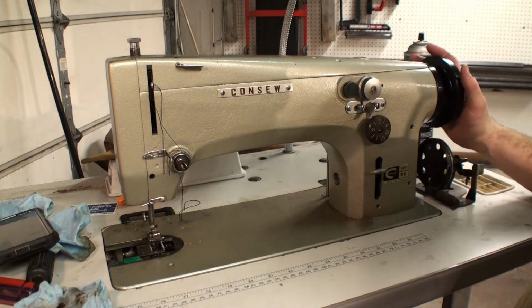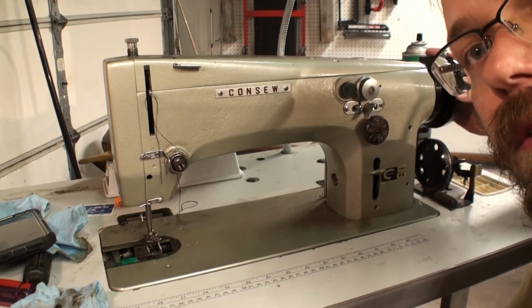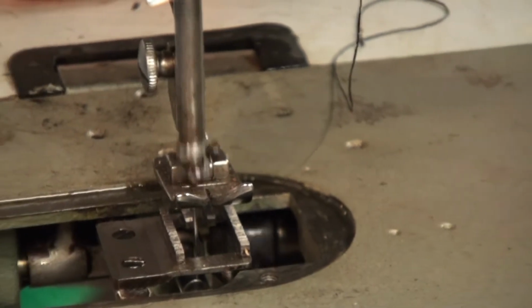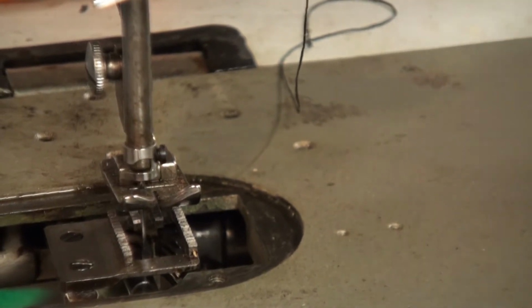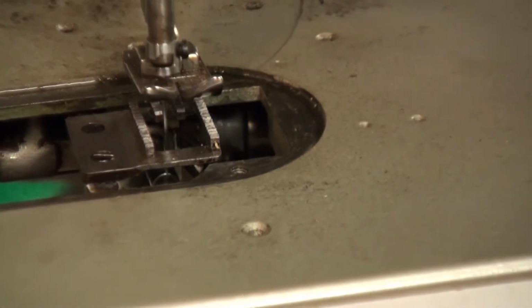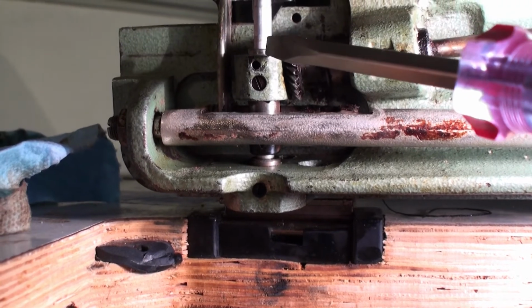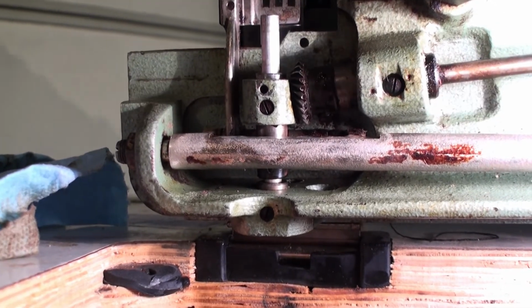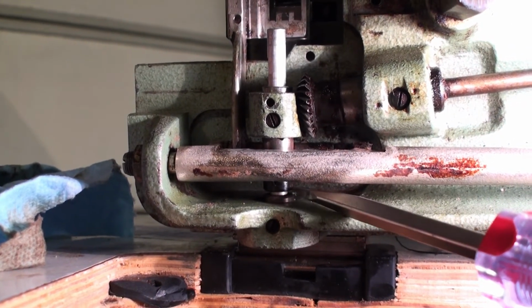Now that we took off that gear, we can see that the machine spins freely now. It's very smooth now. There's no drag, everything moves up. The bottom dog teeth plate moves like it's supposed to. The shaft is held without moving up and down, as the gear holds it from going downwards this way. This black collar keeps it from going the other way.